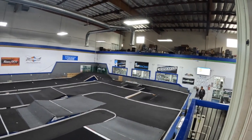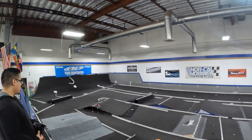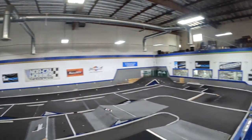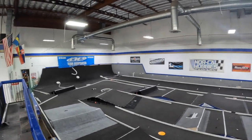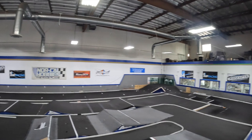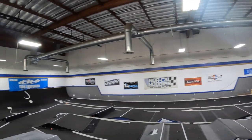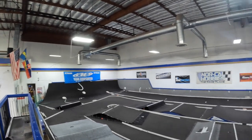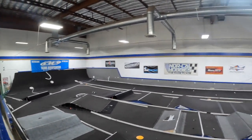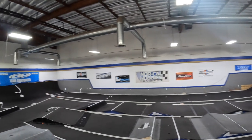To be honest, they don't make that much difference. I'll show you at the end the pictures from the analyzer as I ran it, and once I turned the timing up — although I don't have running video for that — you can see how little the KV changes. Based on motors I've tested, one thing I noticed is the stronger the rotors, the less of a KV difference there was. I don't have anything to test the rotor strength of the Hobbywing right now, but if I had to guess, it's probably a pretty good rotor — there's quite a bit of strength there considering how little KV difference there is.